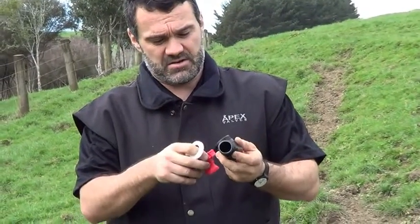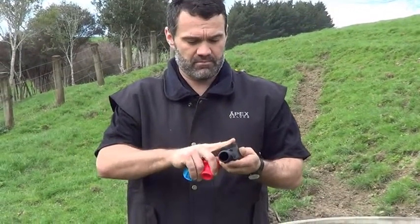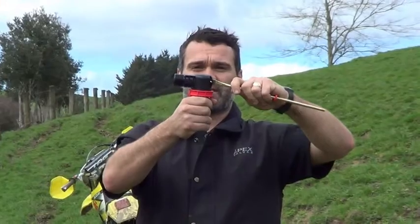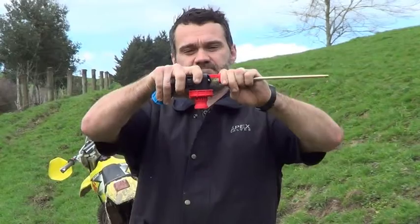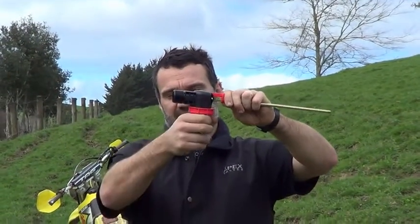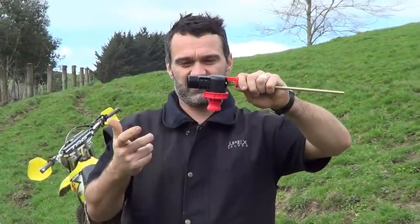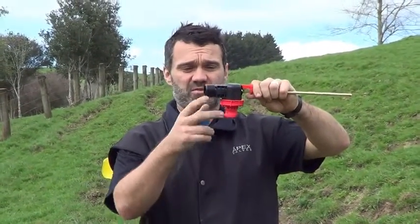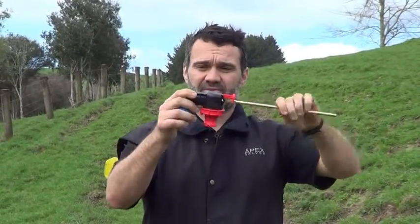So now that's the entire guts of the valve out and it can be fully serviced. I'm going to show you shortly how to service that valve in the trough with the water flowing through it. The third feature, which is what makes this valve very unique, is the cam lock fitting at the bottom. That allows you to shut off the valve with the pin at the top. You've got the ability to connect a cam lock, which I'll show you how to do shortly. You've got a water source anywhere on the farm — you can use it for washing down your quad, washing down your motorbike, brake feeding, or in dry areas for firefighting.